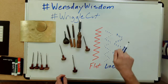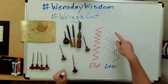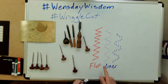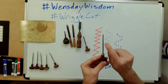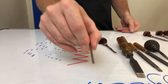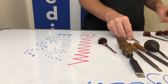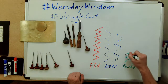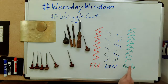Liners are typically seen on vintage instruments — Mark VIs and older Conns use them quite a bit, giving that broken dash pattern. Another style of graver is called rounds. On this 61 round, the bottom is actually rounded, and when you use it in that zigzag motion, it creates a clearly defined crescent shape — noticeably different from the flat-bottomed cut of a flat graver.